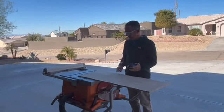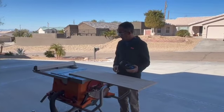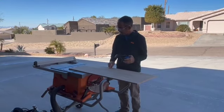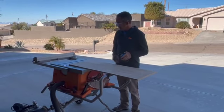Okay, first step is going to be to cut this to size so I don't have a larger leftover piece. I'm going to run to the table saw real quick. I'm going to put the nice side up because I'm pretty certain it's going to splinter on the bottom since we're cutting across the grain. So we'll do that and then we'll cut it down to size.